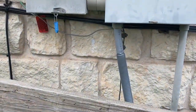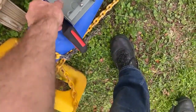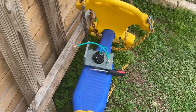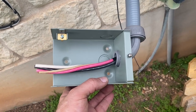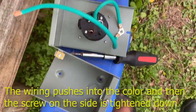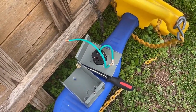I've attached the little pigtail off of the conduit here and I have the wiring. I've got my little box and I'm putting that on now. So the box will go on like this and it's pretty much just wiring that up — and the hard part of this job is done. I will get that wired up and show you the final wiring on it. The box I'm using is color coded: red is going to go here, white is here, black is there, and of course green goes to green, which is the ground. Pretty straightforward and easy.